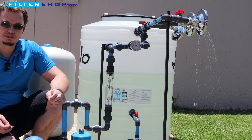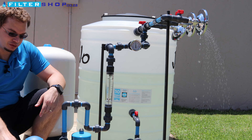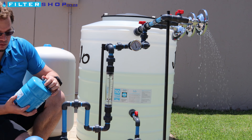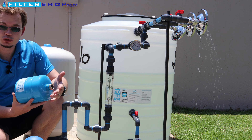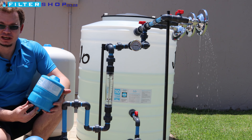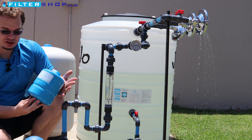This isn't great for the pump's life. It's also not great for power consumption, because at that low flow you're basically drawing the maximum amount of power on these dump pumps. If you want to get around that, what you need to do is add some sort of a buffer in place.